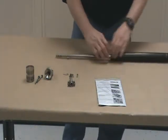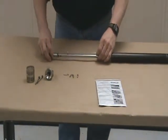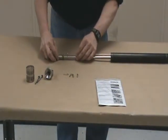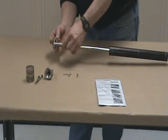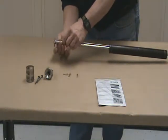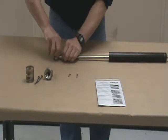Okay, when we put the bottom T-weldment on, slide it on, make sure the control rod goes through the bushing hole. Get it flush with the end of the discharge tube. Align the holes and put your clevis pins in. Put your keepers back on your clevis pins.